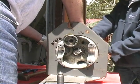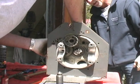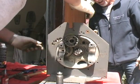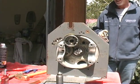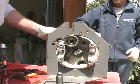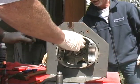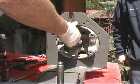All right, ready? Yeah. We don't want that baby to come apart. No, sir. Now, to keep it from coming apart, you depend really on the Loctite. Correct. And you didn't skimp on the blue Loctite, right? And we made sure the threads are extremely clean, so there's no grease. That way the Loctite can adhere properly.